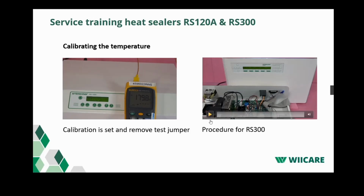And now we'll go to the next video, which shows the RS300. In this video, I show you which control to use when calibrating the temperature and pressure of an RS300 machine. First, you have to disconnect the cable from the USB connection so that the second line in the display becomes visible. Pay close attention to how the cable is connected so that you can connect it back in the right way afterwards.